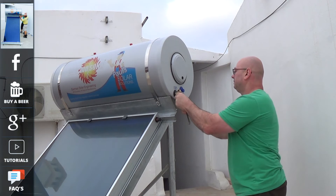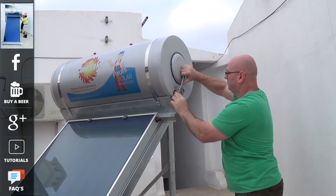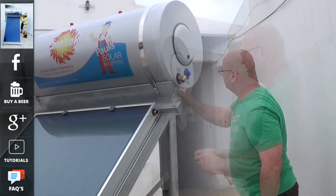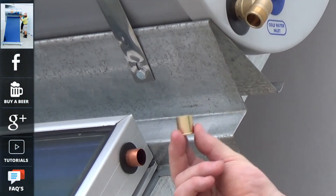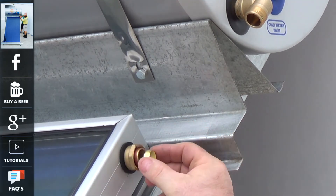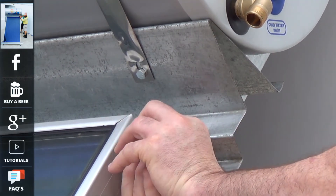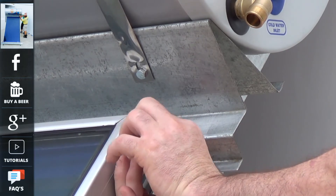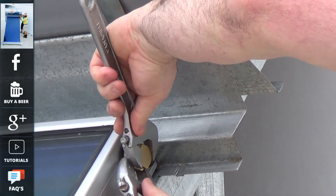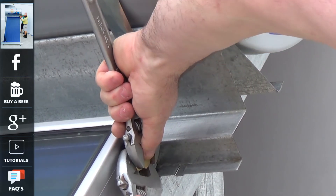Hemp and paste handles the temperatures much better as the hot water side from the panel can get to some extreme temperatures. These systems have a life expectancy well in excess of 25 years if maintained correctly. The solar panels themselves have four tubes coming out of them, so you can join panels together. But on the single 150 litre unit, we are going to be blanking one, using one as a drain off, one will be the hot feed going to the tank, and the other will be the return. It is important to use the reinforcing inserts on the copper pipes on the solar panel, which will protect them when the compression fittings are being done up.